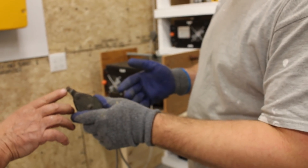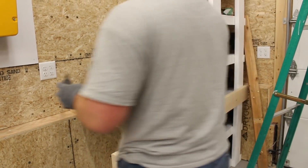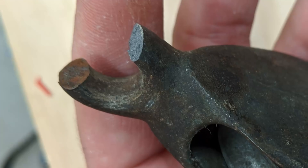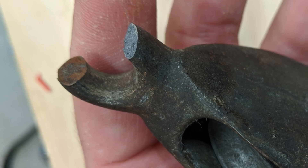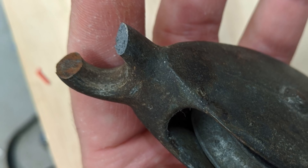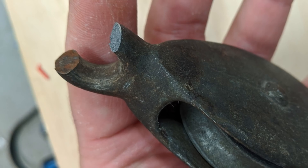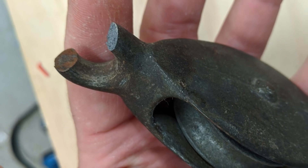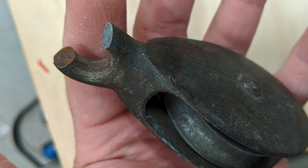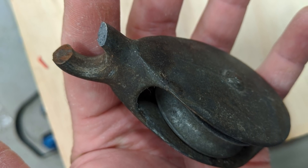It's cracked — see, that's how it rusted. That means it was cracked, so it was only holding by that one side. This pulley should have been plenty strong enough for this task. There was no indication that anything was wrong with the pulley. After it broke, we can see that there was rust on half of the ring where it snapped. This indicates that there was actually a hairline crack going all the way through the ring of the pulley. So the ring of the pulley was only being held on by half the material, which weakened it to the point where it broke under our load.